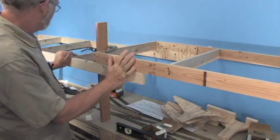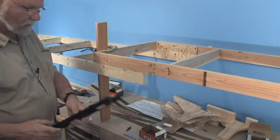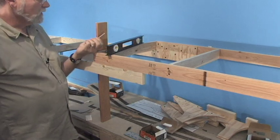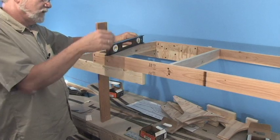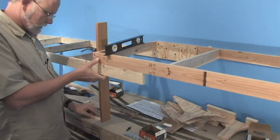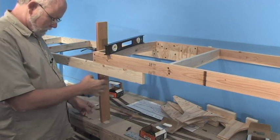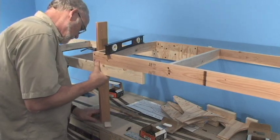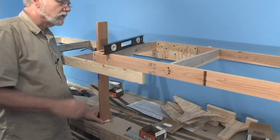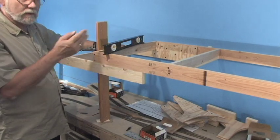Both pieces of the new deck are screwed into the back wall good and strong, but now we've got to make the final adjustments for level on the front. Using the level again, I'm placing a little chunk of one-eighth-inch wood shim on the back to preload and raise the front somewhat. I can see it's got to come up a little, so I slide in a shim of wood plus a couple pieces of cardboard, and now we're pretty close.